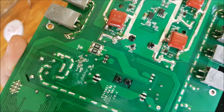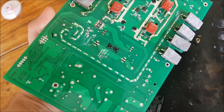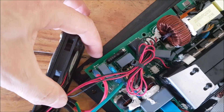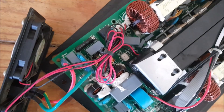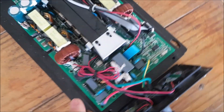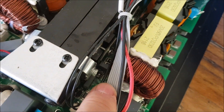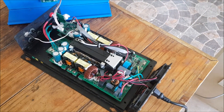I will look under the lens again to find anything else, then just put back the diode and try it again. I know the fuse is blown — I will replace it with the fuse from the other inverter, since that one is still working. With a little bit of luck the inverter is actually not faulty at all. So I changed the fuse and reinserted the diode — but when I plugged in the inverter it blew out that IC again on the other side. Now there is another diode that went dark, so this inverter unfortunately also failed.